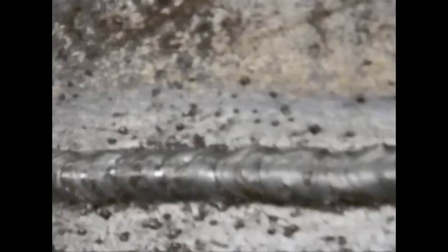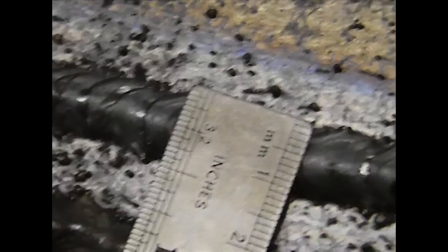There's my crescent shaped motion on the plate — that gives me about a quarter of an inch wide bead. So you got a good look at what I was doing. You want to try to replicate it? But this time, let me put my welding helmet on before you start welding.